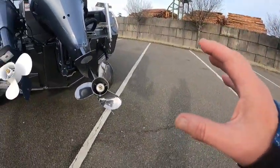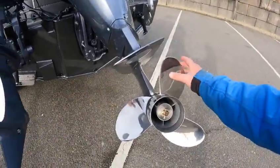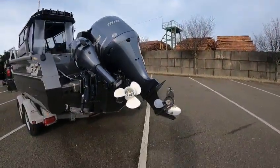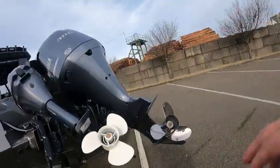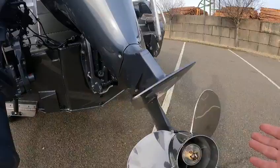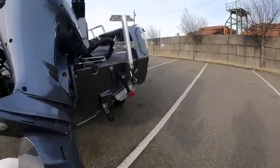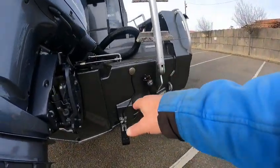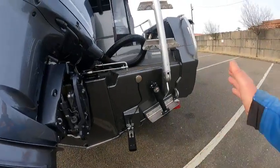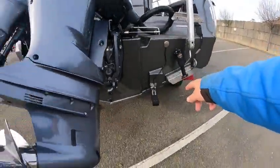Go with the Yamaha saltwater series — this one is saltwater series two. You get a lot less vibration and a pickup in speed. There's a big difference with stainless: the way they pitch and cut them, you can feel how sharp they are. Two coats of primer, two coats of clear, main paint. Internal zincs — every cylinder, zinc on the block, zinc underneath. When mounting a transducer, mount it as low as you can toward the motor rather than on the outside, so it reads at higher speed.